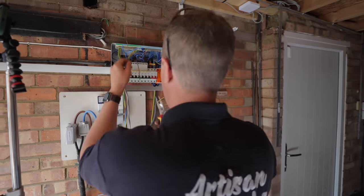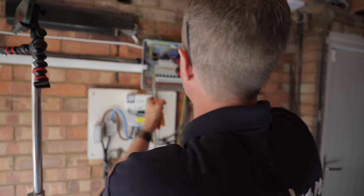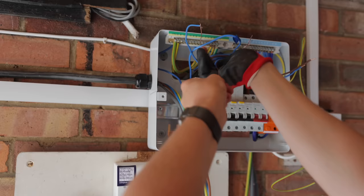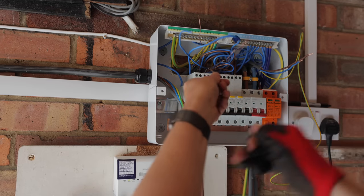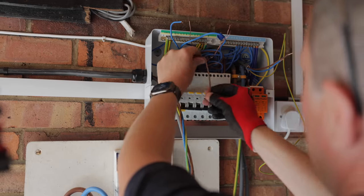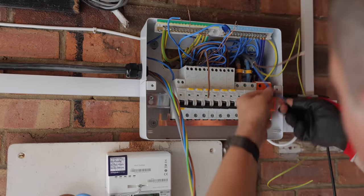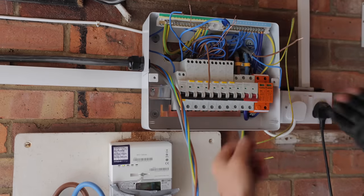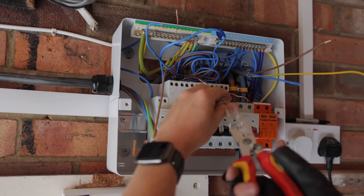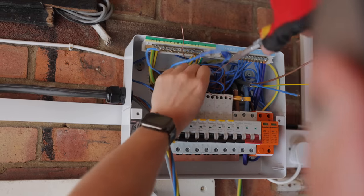Now's the time, my young Padawan, for you to take your training to the next level. You've got to warm the wires up basically. You can do it with your fingers if you've got gloves — just run your hands down them like that and you'll find they get really nice and straight, then you can get a nice loop on them and they look neat. There's nothing worse than little kinks and stuff like that. Use 2mm sleeving — get something like this on them, pull them tight, put a bit of tension on it. Much, much neater.